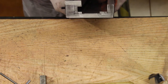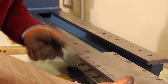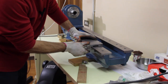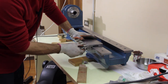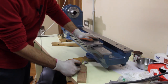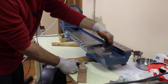Now let's try it on the ways of the lathe. This is the gap that will be adjusted with the screws. This is the reference - this flat face - and this face has to be made flat, following and copying this side.